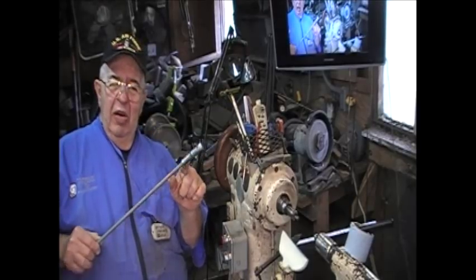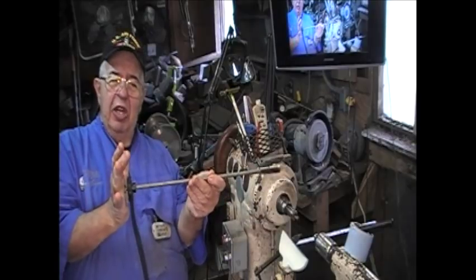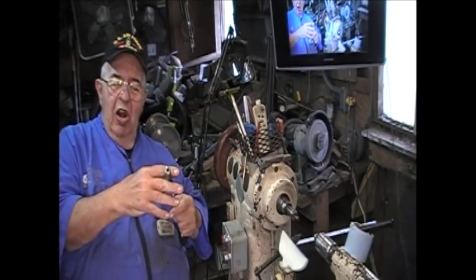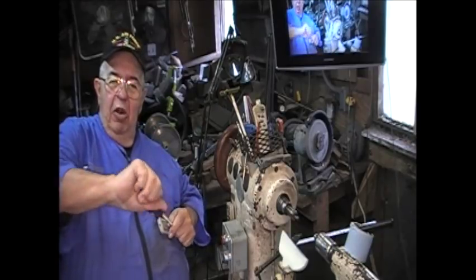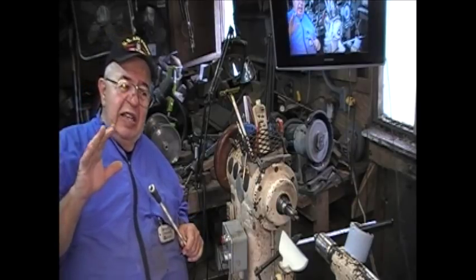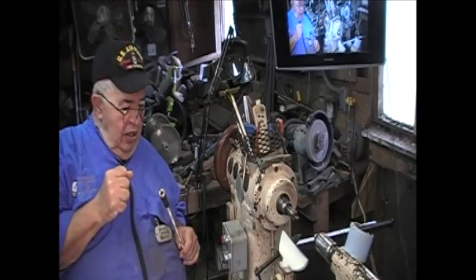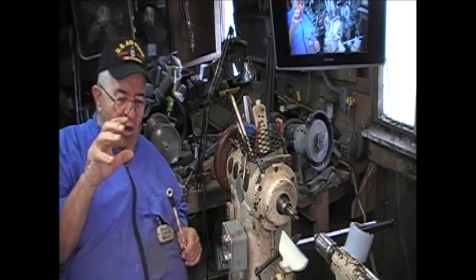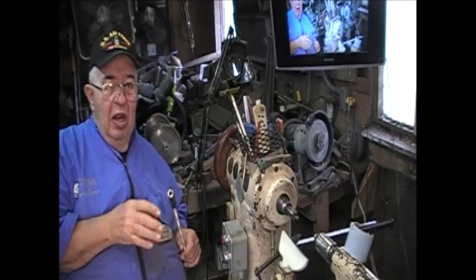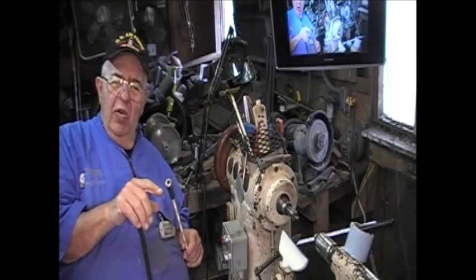all that stuff, then when I want to free it up, all I do is back off this a little bit, slap this with my wrench. This pops out a little bit, takes the friction off, allows it to open up a little bit, and I pull a piece off, slide a new one in, and go the other way around, turn it back down again. It doesn't crush the dowel. A lot of the chucks have so much force, they'll crush the dowel, and it'll screw it up. So you don't want that. All you want to do is hold it.